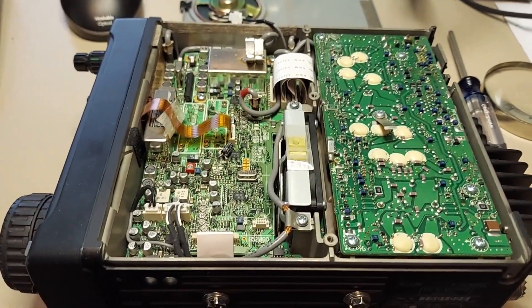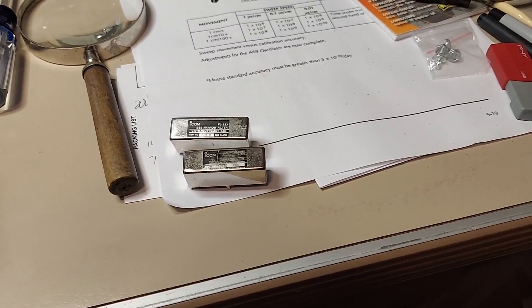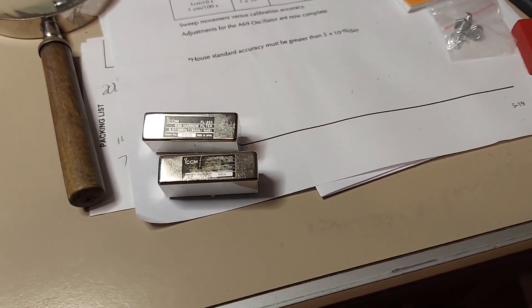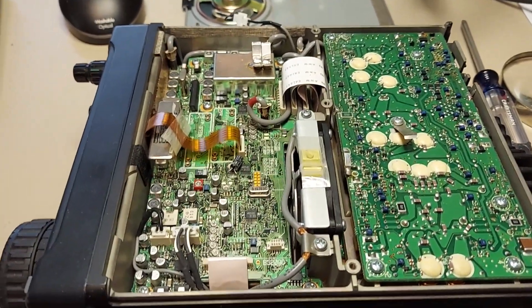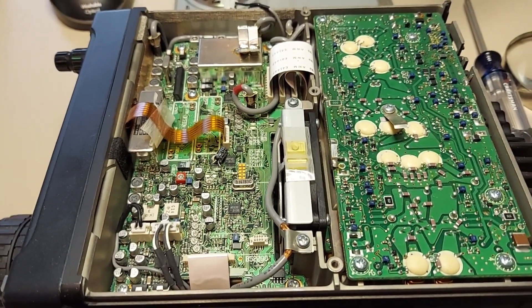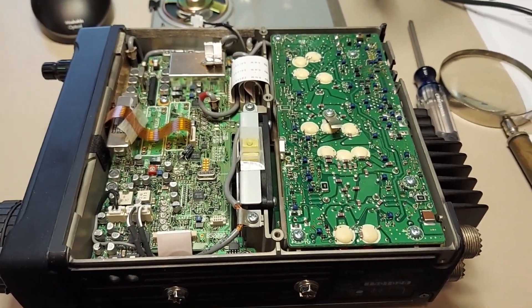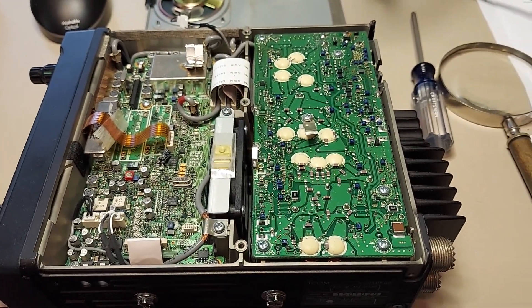There she is — all open and ready to go. One little side note on these filters: be careful cleaning them. There were some fingerprints on the CW filter I wanted to clean off, and I noticed that the labeling on there is just printed on, so a little bit of it came off. One other side note on the 706 Mark II G is that it doesn't matter which crystal goes into which socket, because when you go into the sub-menu you just set that up — you can select any socket for either mode. I did blow it out a little bit; it had some dust in there, so I used some canned air on it.